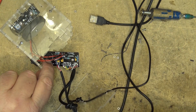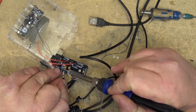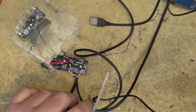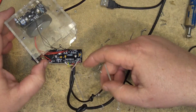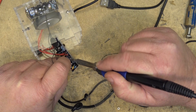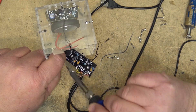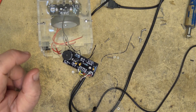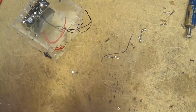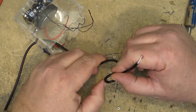I need to disconnect my wires since I do need to reuse them. I really just need the power wire — I can leave the rest attached. The wires for the blinky lights basically just have an audio signal, power, and ground. I'll unsolder the power switch since I don't need that connected to the old board anymore, but we are going to reuse this power switch. Now that the back cover is out of the way I'm going to bring the power lead in through what used to be the volume slot and tie a knot for strain relief.